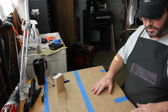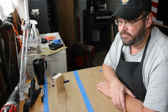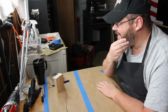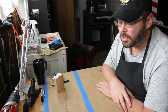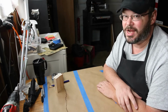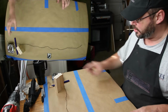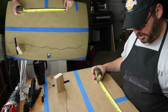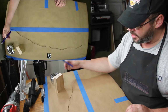So what we have to do is we've got some indentations in the fretboard that we have to sand out, but I just can't take a sanding block and sand it out because it's curved, and that's the radius we're talking about. Now, the Martin has a 15-inch radius, and here's what this is. I've got a couple of marks here on my table, and from mark to mark is 15 inches because the Martin has a 15-inch radius.